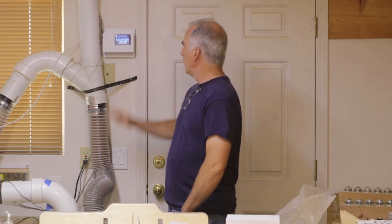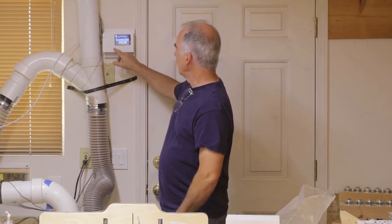It reads the amperage off of the dust collection monitor. I'm also planning to add onto this project an automated dust collection system that will turn the dust collector on and off and open the correct dust gates. I'll be adding an amperage sensor on every tool in the shop, and on every dust gate I'll have a servo motor that opens and closes it. So I'll just turn on the table saw, all the dust gates will switch to the right position, the dust collector will turn on, and then some seconds after I turn off the table saw, the dust collector will go off. That project will fit inside this box too — there will be a little extra servo board, plus a lot more wires going to all the tools for the amperage and servo connections.